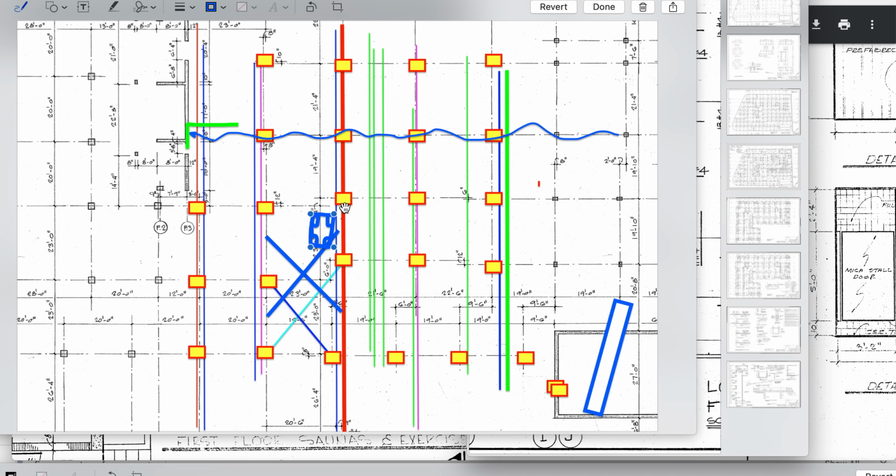on is actually pulling over here already, because there are no beams here. And there's only one piece of steel connecting these columns. Maybe this is the larger column. So two pieces of steel connecting this together. But on this side, there's only one piece of steel connecting together. So over here would be the stronger side to be on, and this would be your weaker side.